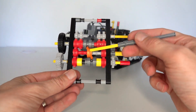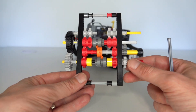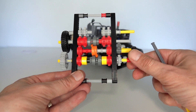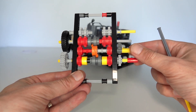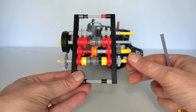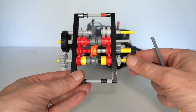The challenge was to find a combination of a rotary catch, switches, and gears to implement those four different tracked combinations. After playing around, I came up with this configuration implementing the steering mechanism. I've got the input at the bottom, the left output track and the right output track represented by two axles. When I rotate the input, the two outputs go in opposite directions — rotating forwards makes the left track go forwards and the right track go backwards. Switching the rotary switch reverses them, so the right track goes forwards and the left track goes backwards.